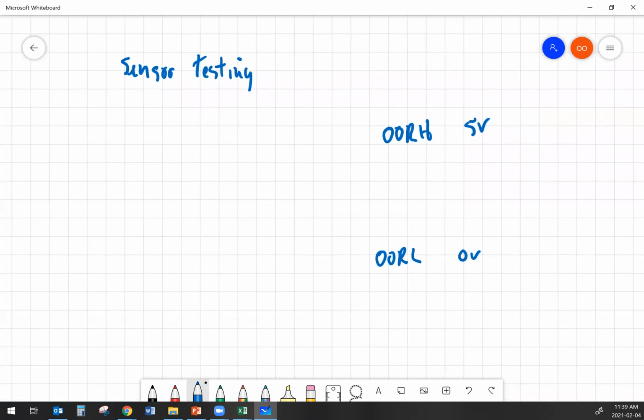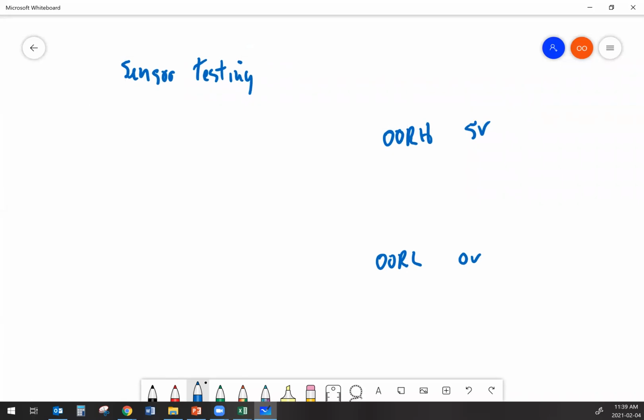There is a standard that a lot of modern manufacturers adhere to. That's your SAE J1939, and it defines a lot of stuff in terms of electronics. But one of the things that it does define is certain numbers that are associated with certain problems. And you have things like MIDs, PIDs, FMIs, and what that's really talking about is your first portion of a proper SAE J1939 fault code.